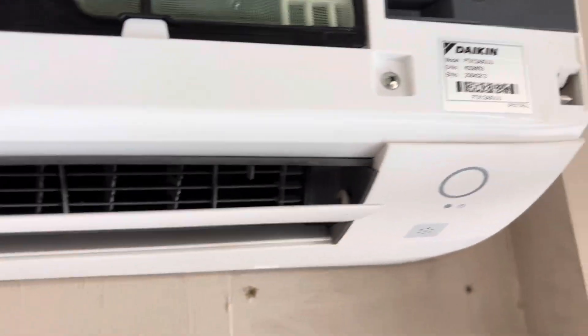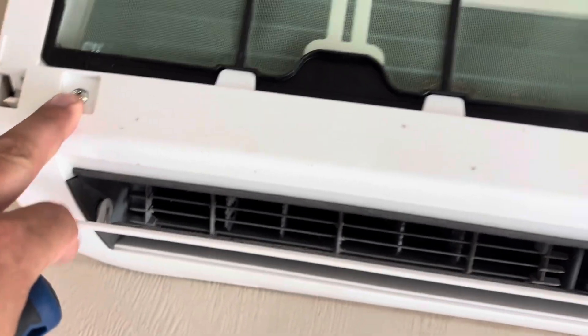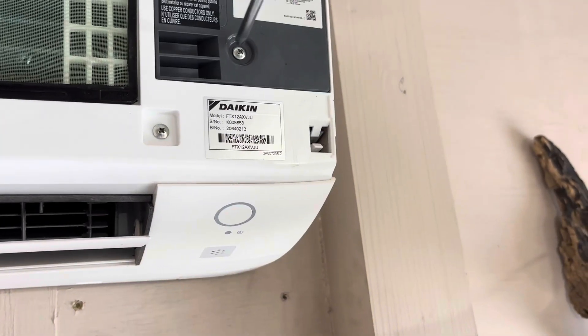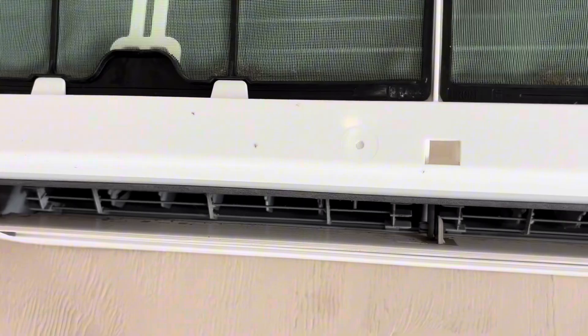This is a smaller one — it's only a 12,000 BTU. I did a 24, or it might have been an 18 this morning, and I had a whole lot more screws than this one had. On this one, we have a screw here and a screw here. The larger models, you're going to have screws along here, one here, one here, and then three or four along here. Let's take this screw out and this cover — make sure we don't have anything right behind here. We don't. Taking these two screws out, we'll loosen this cover and the whole thing will come off.